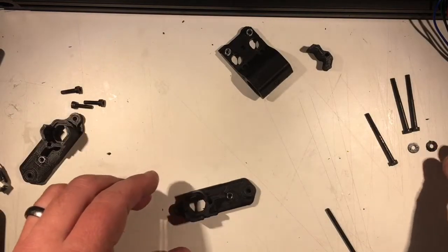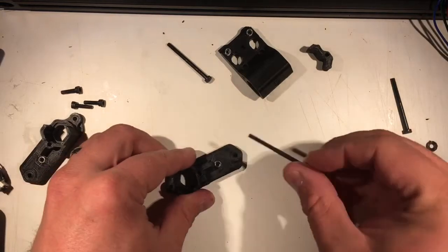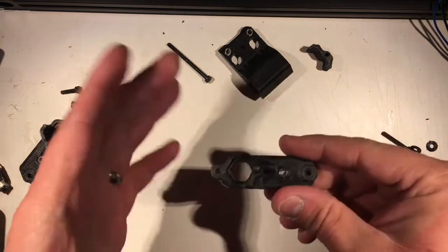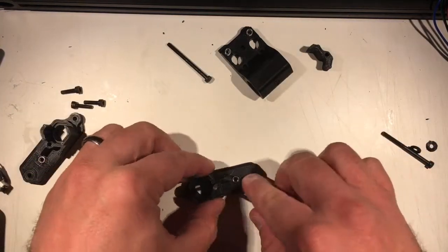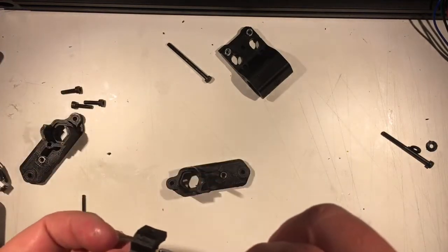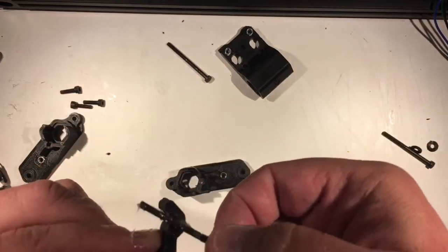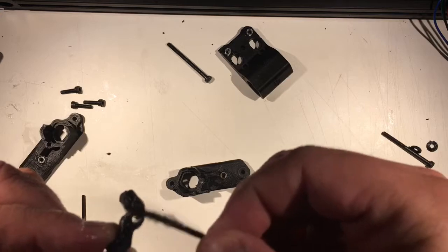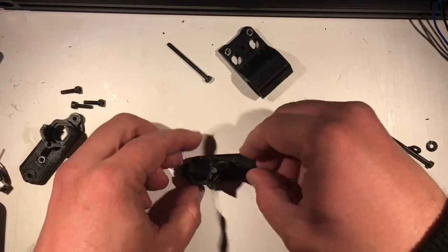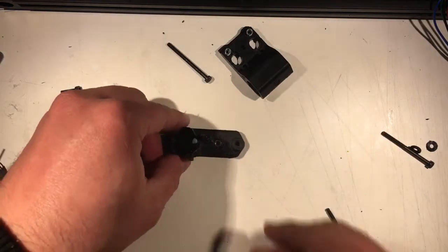They will get sucked in when we insert the bolt. This is much easier now. Let's take our other bolt here — this is sort of the middle carriage now that there's stuff hanging off the other end of it. We're going to take our rocker actuator and put some grease on the inside of that as well, because it needs to be able to slip. I'm also going to add grease to both sides of it because it's going to be sandwiched, and although there's plenty of clearance, I don't want it rubbing against the sides too much.